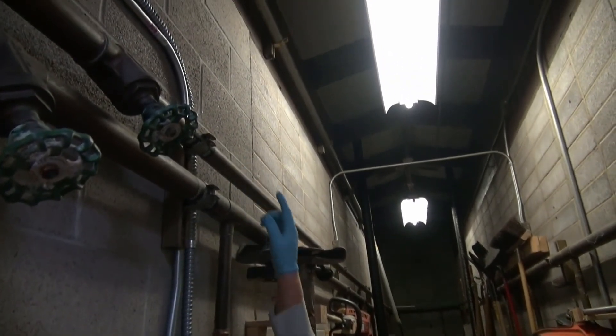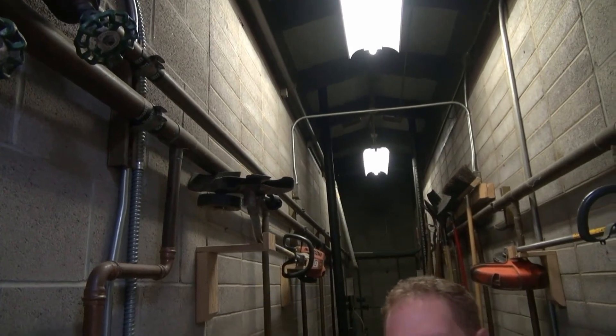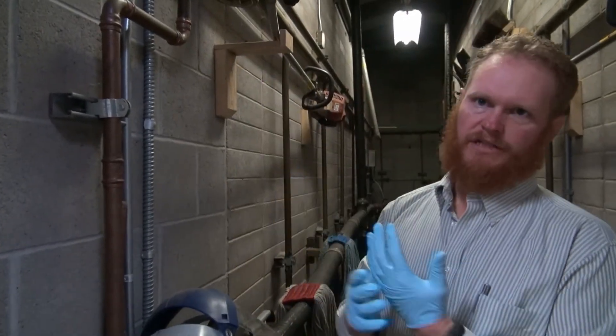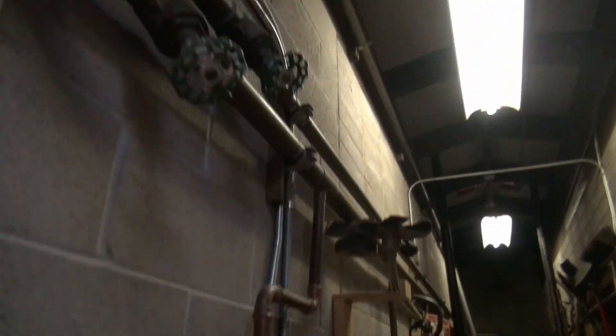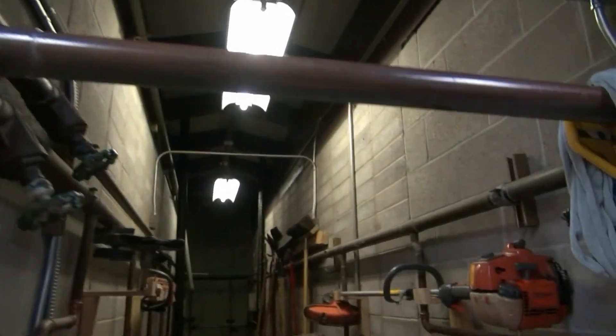This upper pipe is for hand washing and drinking fountains — so potable. We call this a dual plumbing system. One line for non-potable and one for potable. A lot of comfort stations are already this way, so already plumbed for recycled water effectively. That's a real benefit and we should take this into consideration when doing future designs, as this dual plumbing makes recycled water a possibility.